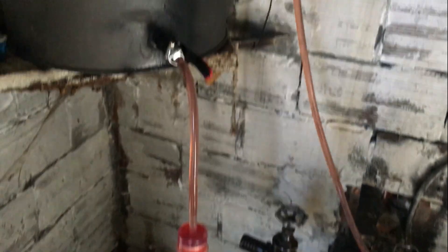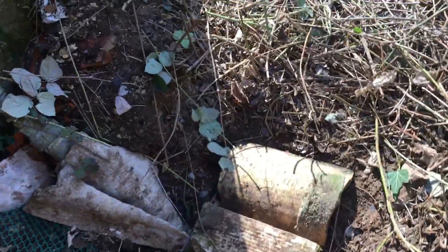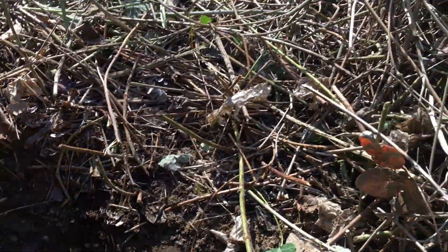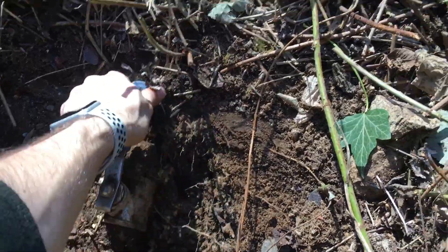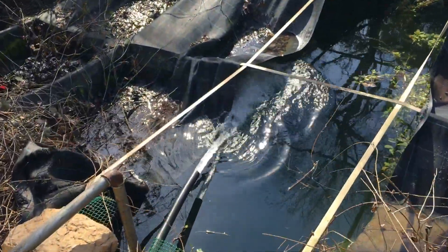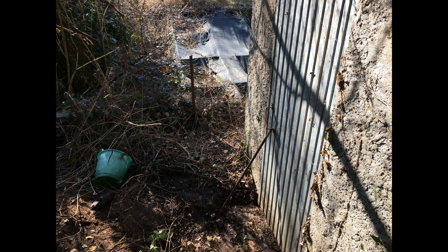The floor needs redoing as well — I will put some plastic tiles or something. There's water up to the rim in the water deposits back in the house. The only thing that's left is to drain the pipes. There's a valve here, and this empties the whole system into the pond. That's all for now, thanks for watching, and stay tuned for episode 3.